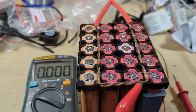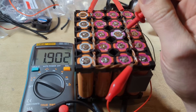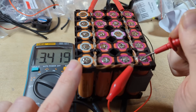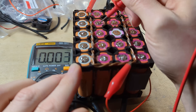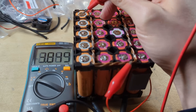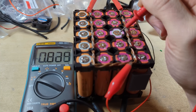I'm going to leave that for a few hours and test the voltages again later today. Well, it's been less than two hours — an hour and 45 minutes since I last checked. Let's check that one — oh yeah, dropping like an absolute stone. 1.9 volts. That needs to come out. Let me quickly check the others — oh, and we have another one: 1.6 volts. Yeah, 1.6 volts, definitely one to take out as well.